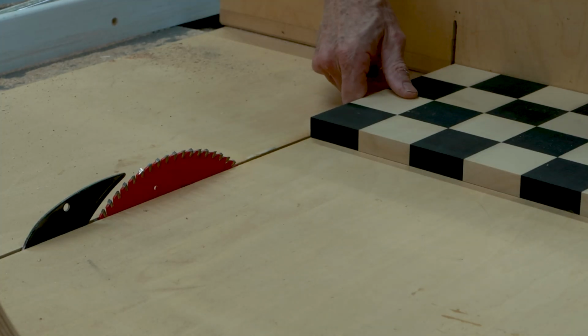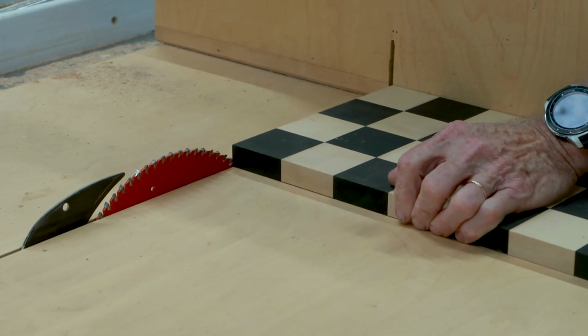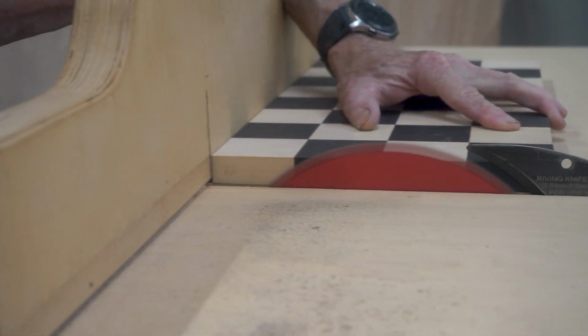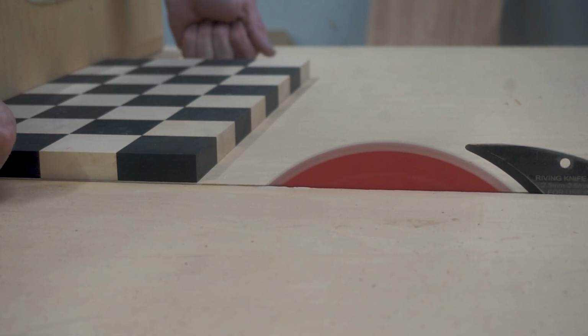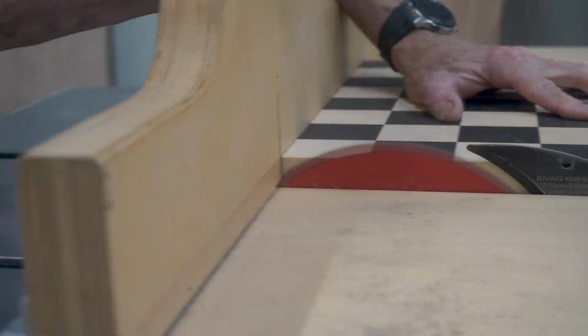Before cutting the groove into the edges of the playing field for the tongue and groove fitting, I need to trim the edges and take off the tiniest amount possible to eliminate any unevenness that was introduced during the last glue up. It's impossible to avoid a bit of trimming, but this one is lined up pretty well, so I don't have to remove much at all.